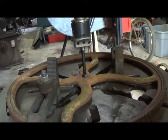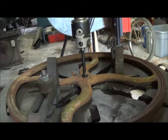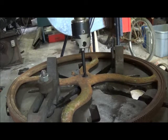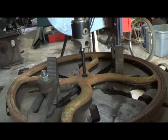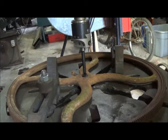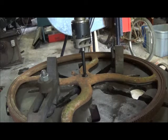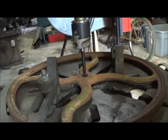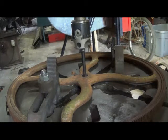We've got it going down in there now. The reason I'm not using a three-quarter drill bit is I've never been able to drill a three-quarter hole with a three-quarter drill bit and have it actually come out three-quarter — you're always going to have a little bit off. I want to get this thing as close to three-quarter as I can. I think this will work out just fine. I could have set it up on the vertical mill but I just wanted to see what we could do with it.